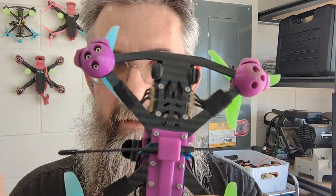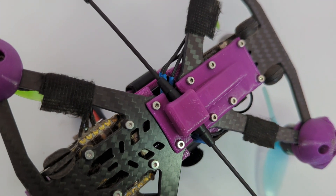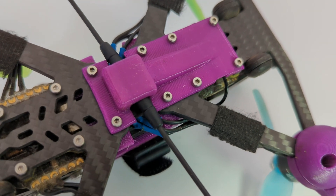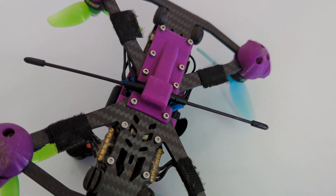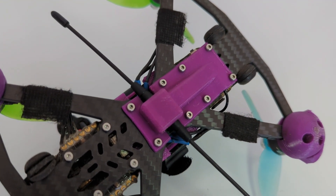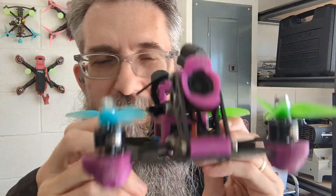For the receiver antenna, you can put your receiver antennas in a lot of ways. If you're running ELRS, you'll likely have very small antennas or a ceramic antenna inside, and you wouldn't even have this issue. But if you've got antennas sticking out, the best location is in the middle of the frame underneath, with the little antenna sticking out either side. I'm running Crossfire — these antennas are huge — so you definitely want to do this. This is by far the most durable and protected location on your frame. I've tried front, back, off the arm, the little L configuration — this is by far the most durable and provides really good reception because it gets the antenna away from the frame and in an area that's generally visible no matter which way your drone is turned.